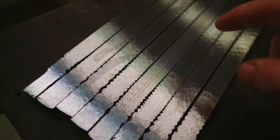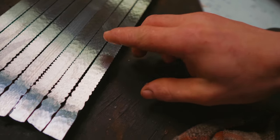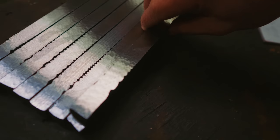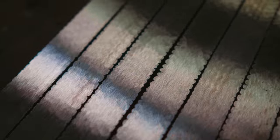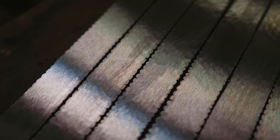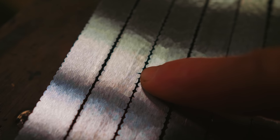Let's get right into finishing up this Damascus. So here's where we left off last night. We have these pieces surface ground up. This is obviously our Turkish twist. You can see that we have it ground on two sides so that our mating surfaces are very clean as we weld it together. But now that it's the morning and I've got fresh eyes, I'm looking at this and seeing that actually, those twists, we haven't ground all the way through them. And something like this could easily form an inclusion that severely damages the integrity of the blade.